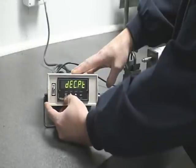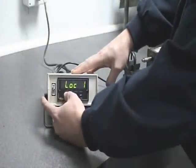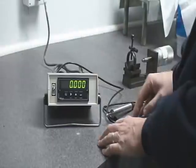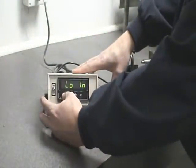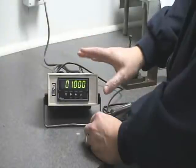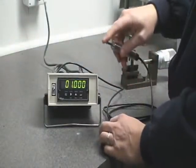Now scroll through until decimal point. I want it to read three, and we scroll through to reset. Next, take your readings, and if you're more than one percent off, you can always go to your high read and adjust accordingly, because you have much more room to adjust to get within one percent on the highest reading.